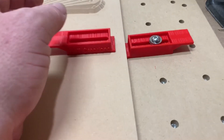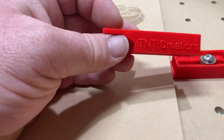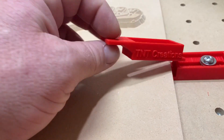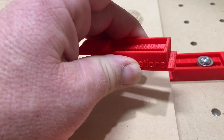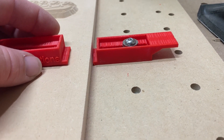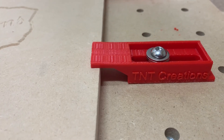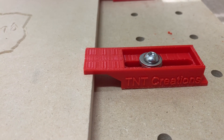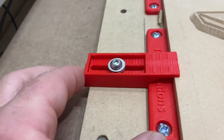So then we come up with this new design. The new design has a support up under here to keep it from flexing so much, and you can still use the back side but you don't have to flip it over anymore. Now again with the flex on the old one — no flex on this one, well minimal flex — and you can still reach over your straight edges and still hold down the work.